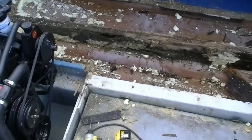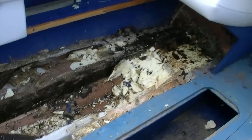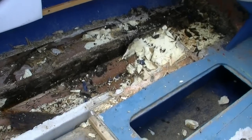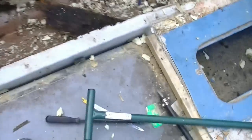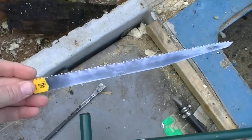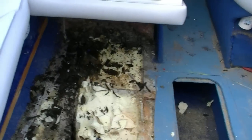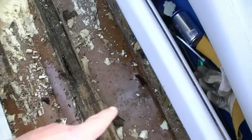I think I'm done for the weekend. I got that side devoid of foam, and I'll tell you that stuff is a pain in the butt to get out. You don't want to get too rambunctious with digging tools because you can poke through the bottom of the boat, so you just want to make sure you take your time. I've found that a pry bar — sliding in, prying up, sliding in, prying up — works great. And I use this big saw to cut them into chunks and break out the big chunk. See how much is in the bed of the truck so far, and I still have that huge block and all this back here to get out.